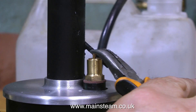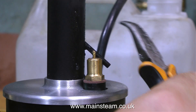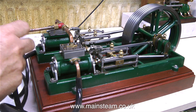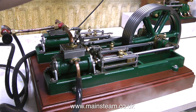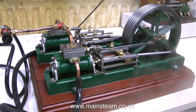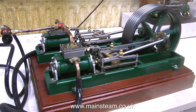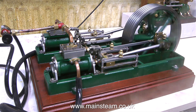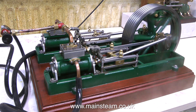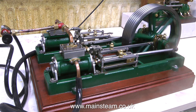In a similar way to the coal-fired boiler featured in the last video, this boiler, because it's new, is priming — but this will get better after about half a dozen steamings. By lifting the safety valve and watching the water spout come out, obviously the water level in the boiler has dropped with the subsequent pressure rise. Less water, same heat, equals more steam — so the engine is now running faster. The engine's beats on steam are slightly uneven, but I'll fix this by adjusting the valves when I get the steam plant finished. I'll stop talking for a while and just let you listen to the engine, first of all in slow motion.